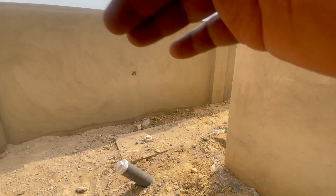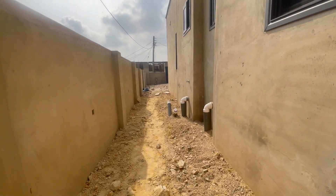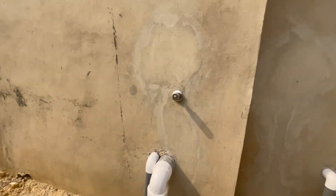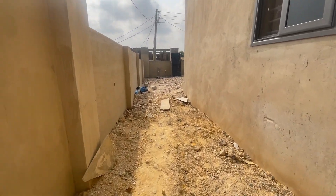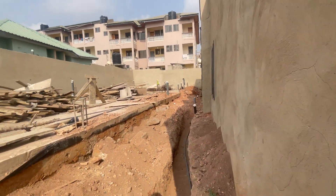I just want to show you the kind of facility that we made and the reason why we decided to do the digester the way we did it. I don't like things placed on top of pipes — I have a feeling that if it rains, water will seep through. If it's an end cap you're putting on, it should be best to put a vent cap on it. Vents should always go up — that's my argument. If you think something is not right, you can leave a comment and we can have a discussion. The pipes have already been laid.